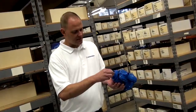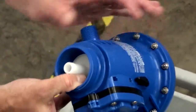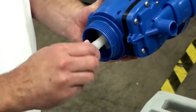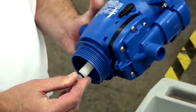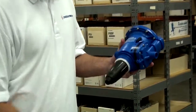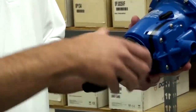Next, reinstall the isolation body. Make sure it's seated squarely in there and use 2 thumbs if you have to. Push the plunger back into the housing. Turn it a quarter turn clockwise to lock. Then, test its connection by pushing and pulling the plunger. The unit will click. Reinstall the stem, and then reinstall the stem nut. This only has to be hand tight.